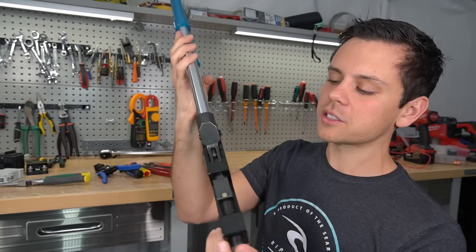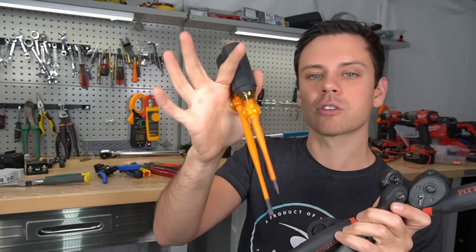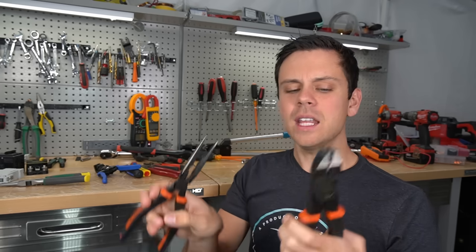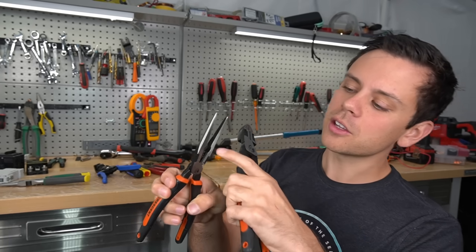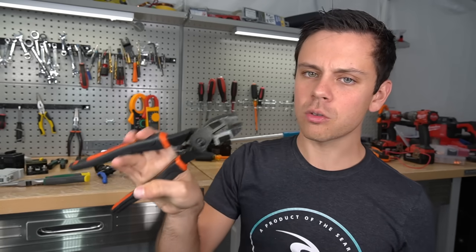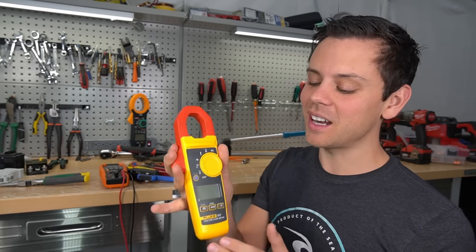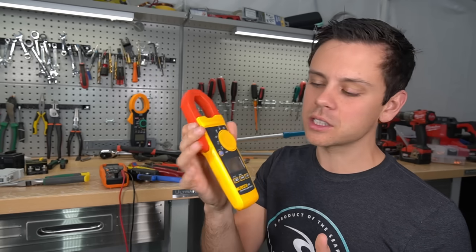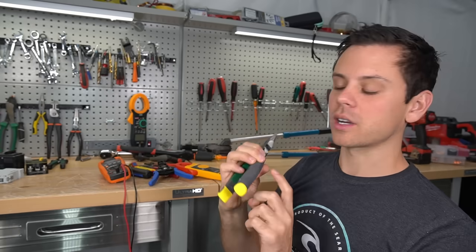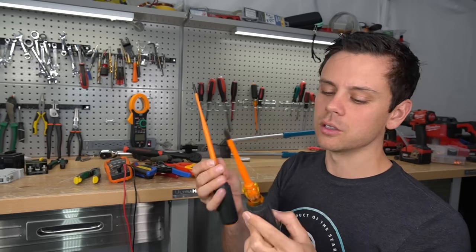If you're working with live batteries, you should buy insulated tools — insulated ratchets and high-voltage rated screwdrivers. Please use these if you're working with current sources you cannot turn off, such as battery cells. Even for pliers, buy the electrical-specific ones — there are little features on them made for electricians that are very useful. Do not try to use a plier to crimp a connection; always use crimpers for crimping and nothing else. For a multimeter, if you're a hobbyist, you don't need to spend as much as a Fluke — Klein Tools offers high-quality stuff that works great, and they're made in the United States.